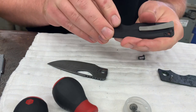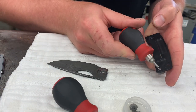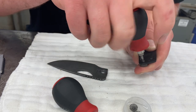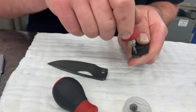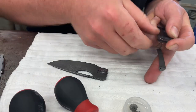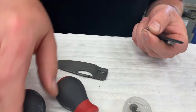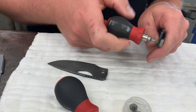While those are soaking, I can show you how to take off your clip if you need to for any reason. It's held on with two dowel pins to align it and keep it from rotating, and one 256 screw. The best way I've found is to loosen the 256 a few turns so the head's sticking up, then press down to snap it off the dowels and it'll come right off. To put it back on, just snap it onto the two dowels and put your 256 screw in.